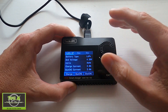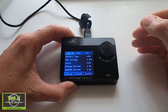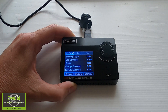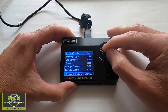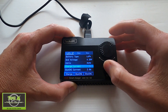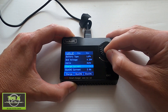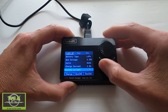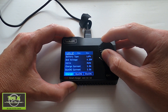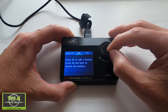I've already done the charge and storage test and reset the charger so I can go through setting up the different battery types — you can set up three. Going back into the battery setup: it's a LiPo, 4.2V, auto cells. We set the charge rate at 1C, so for a 1500mAh battery we dial it down accordingly. We do the same for the discharge, changing it to 1.5A. Then we can select charge, discharge, or storage.